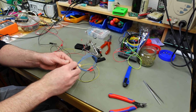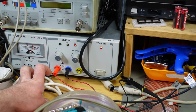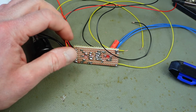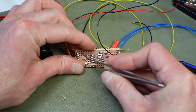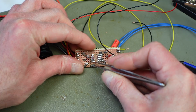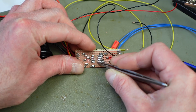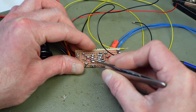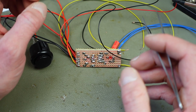That's bad. Why is that? Oh, and it's actually drawing too much current, it seems. Let's switch this to amperes. Okay, that's 1.5 amps. There's a short somewhere. The good news is I probably resolved the issue. My drilled out bit here between pin 1 and that would be pin 8 of the NE555. There was a little bridge there still that I didn't fully drill out, so we produced a short. So worst case, we fried our 555, but I have plenty of those, so not to worry.